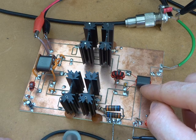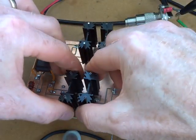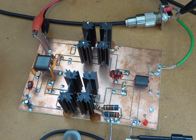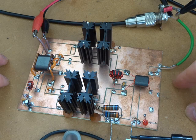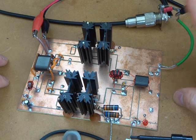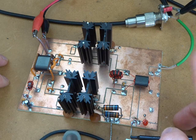It's exactly the same configuration as we left in the last video. Admittedly that output transformer is 5 to 5 — I haven't replaced it with a 7 to 8 — but that's still fine key down, nothing's getting burnt. So 14 watts output is not too bad, but I'd probably run it more like 250 milliwatts in to get 10 watts out. That might be quite a nice little power amplifier versus the LDMOS amplifier that was running on 18 volts to get the same power out.